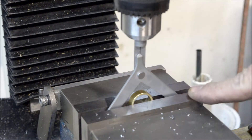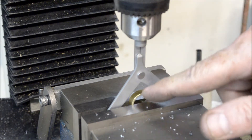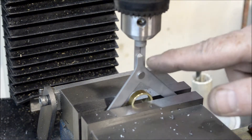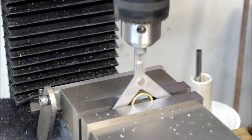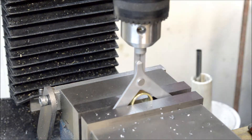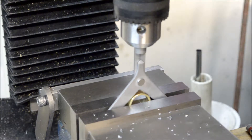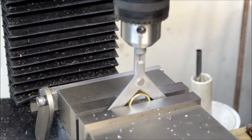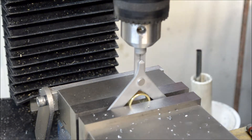I have the brass eccentric locked up in the vise here. I have to do a couple of operations on there. I'm going to start with centering it in the axis, and I've got this little center gauge here. As I move the table in the x axis back and forth, you can see how the little indicator lines up with the line there.